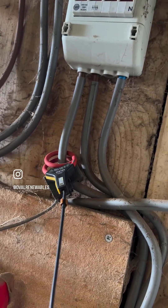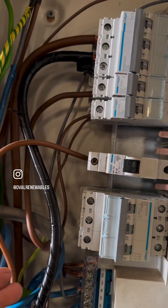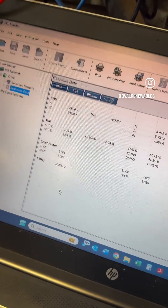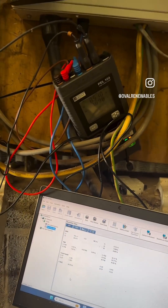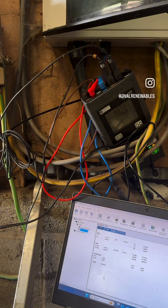That can then go into my PELL 103. I've just got to get my voltage reference from here, which I can take using these two probes on the phases. There we go — PELL 103 is set up. Just going to tidy that up a little bit, but it's very difficult to get all the cables into one place neatly.